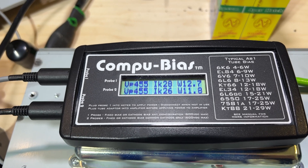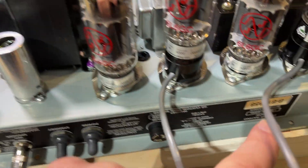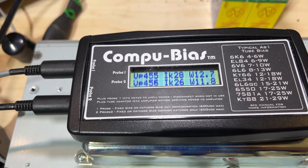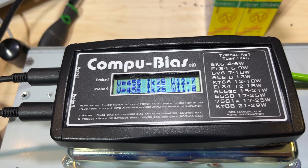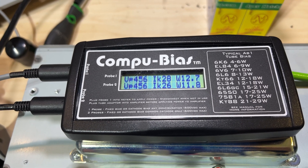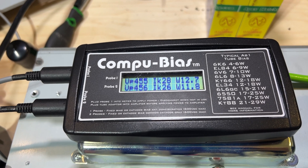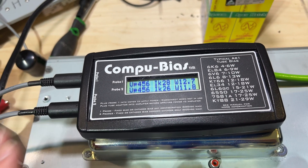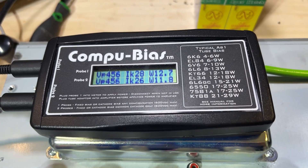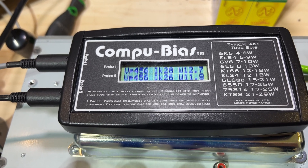Another thing: there are small resistors in the tube socket here that allow us to see the idle current. There's basically a resistor in that socket placed between the cathode — the negative side of the tube — and ground, to measure current as a voltage across that resistor. So we don't want to play guitar while this is hooked up, because we can get a signal in there that would be more than that resistor can handle, which could cause some issues.